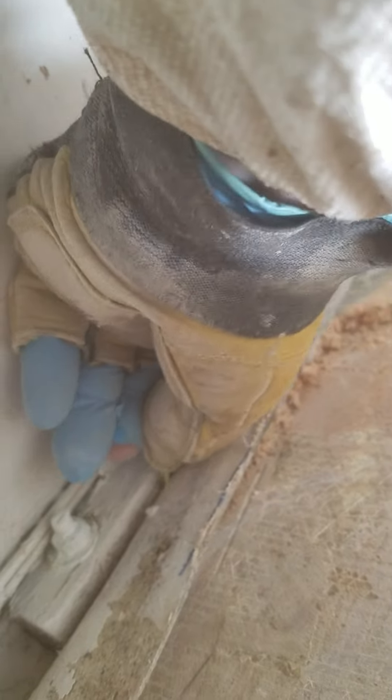The other issue here, which I'm going to point out, is this. You can see that moving. So this is not rotten, but it's loose — and that's pretty consistent. I've got a tool on it so you can see that moving. What that means is that although there is no rot under your rails like it is here, you're definitely going to have to re-bed these if you don't want them to leak. This is going to leak. You need to re-caulk these.